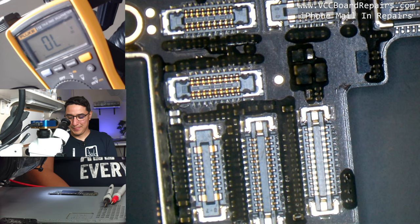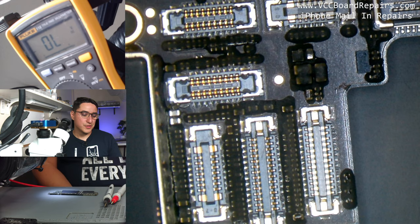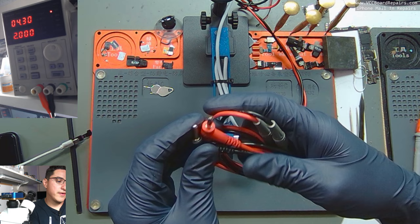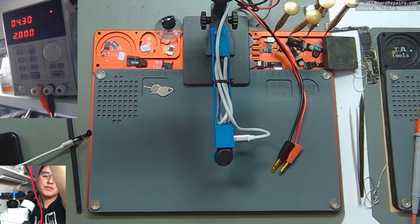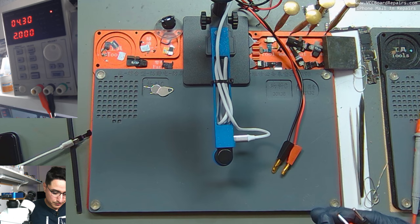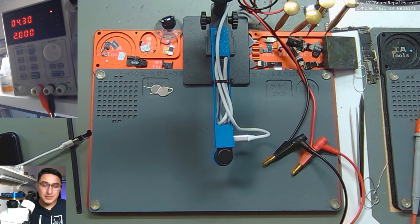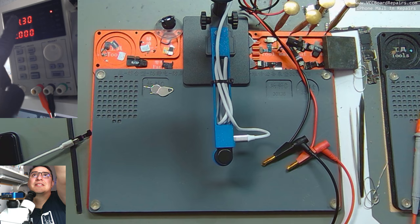I'm going to show you how to inject voltage directly to this line. I've taken regular multimeter probes and cut off the jacket. I'll plug them into my DC power supply using some extension cables for convenience — red to red, black to black. These extension cables have links in the description.